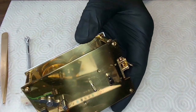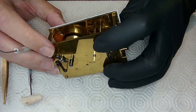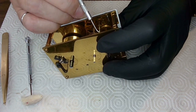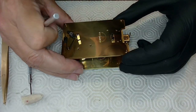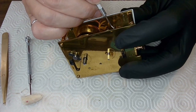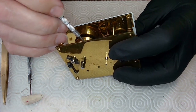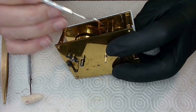I can see one pivot is not in the hole. I'm going to take my tool here and tap the various gears and pivots as I push this down to get them in. It shouldn't be as bad as a pocket watch — some pocket watches are atrocious for doing this. This one's way off, I've got to come up a bit. I don't want to break the pivot — that's the tricky part. Some of these I can just push up and they'll be in the right place, but some are going to be a pain.